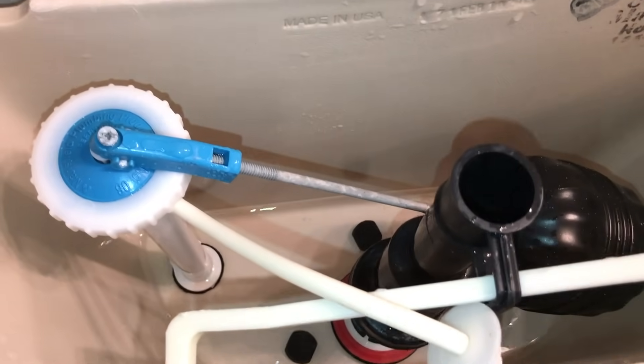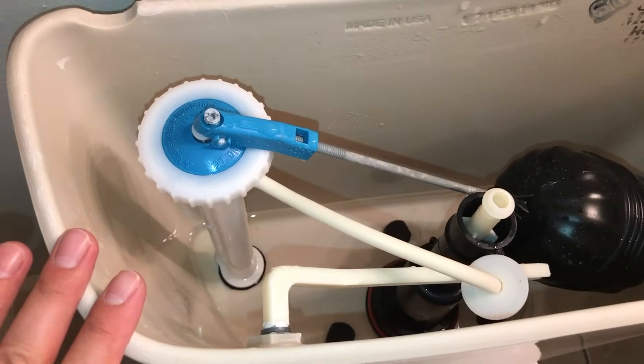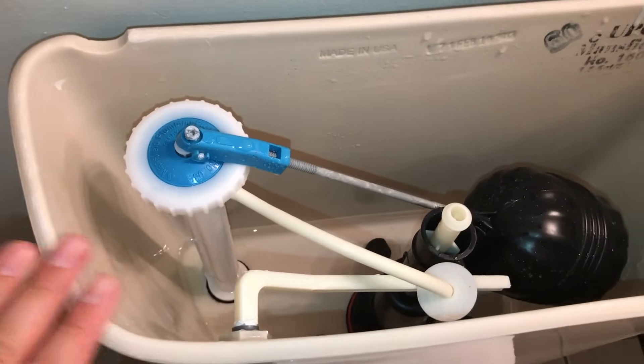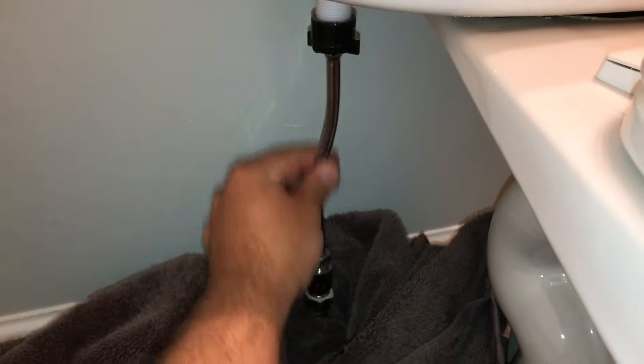What I'm going to do is disconnect the tank from the toilet bowl and empty this in a tub. The reason I didn't do that in my last video was because it was in a half bath where I didn't have access to a tub. To get started with that, we're going to go underneath the toilet and loosen this coupling nut here. Before you do that, you might want to grab a towel and toss it right underneath just to catch any water that may be trapped in the supply line as you're loosening this up.